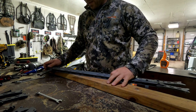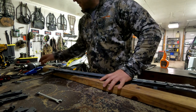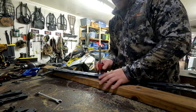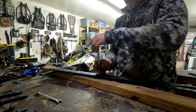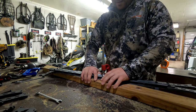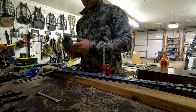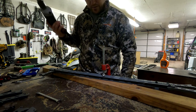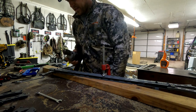Before I even cut them off I like to drill first. Take the clamp and clamp it down good — try to get it right in the center because this is cast aluminum, and if you clamp too tight you could potentially bend it. I have a quarter-inch drill bit, but I usually like to start with a smaller drill bit just in case I go a little bit off. So I'm going to do that — take this drill bit out and go with the next size down, probably 7/32nds.